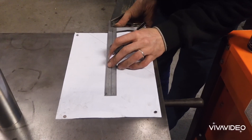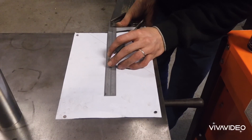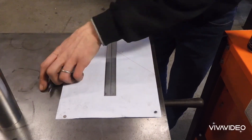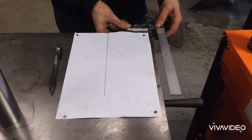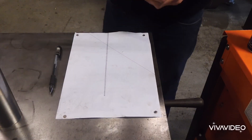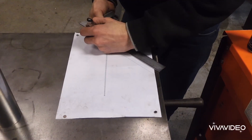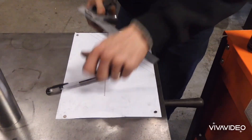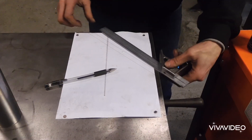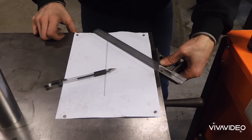We can see that those lines match up perfectly — which they do. Very nice. Because we know that the corner of the surface plate is extremely square, we can then measure the 45° across corners, draw a line again, and yep — absolutely perfect.